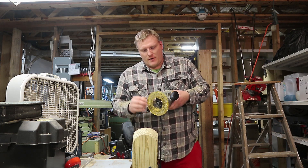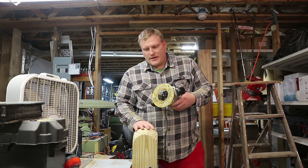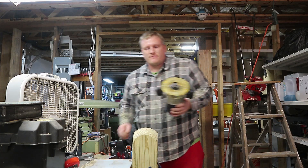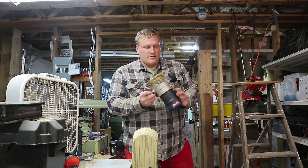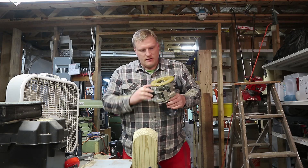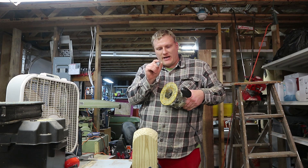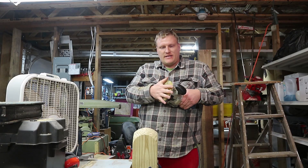Before I moved the base out, it was just cutting and cutting, kept going down, because the radius it was trying to cut was too small for this size of log — this is a 6x6, actually five and a half square. That took maybe 10 minutes, so that's pretty fast. This is not a beefy router — this is just a Ryobi 1.75 horsepower unit. I think this is a half-inch bit. I had to use the shortest bit I have — only a half-inch long — because anything longer would stick out into the base too far.